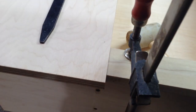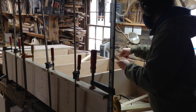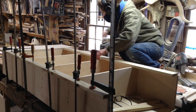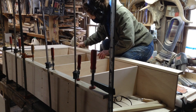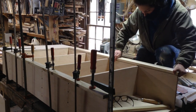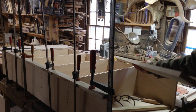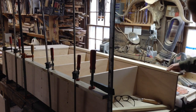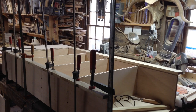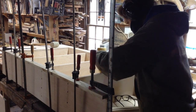That's the burner panel I'm using in place of that long panel that goes on top to make sure everything's in the right spot. Now for this far edge, the wider far edge on both of these bookcases — because I glue them up about the same way — these are going to be detachable. It's going to be easier to scribe this in the space and then trim down whatever needs to be trimmed with a planer or a saw when it's not attached to the bookcase. So you can see I glued it into the stile, then I removed the excess glue, and I just put it back in place. I didn't glue it to the cabinet. So that's how I keep those two detachable. When I get to the space and I scribe it to the room, I can then glue it in place, add a few brads, patch them real quick, and then it's a seamless panel.